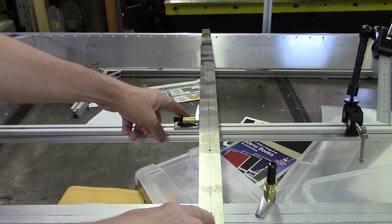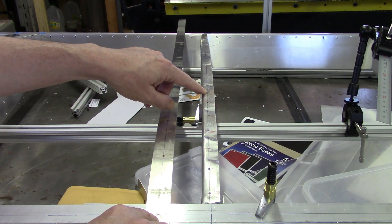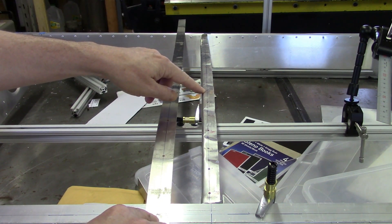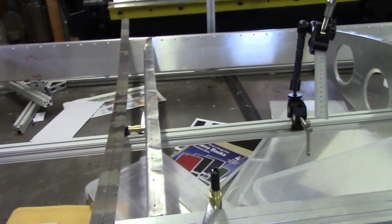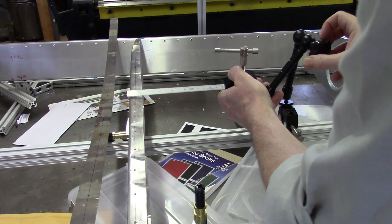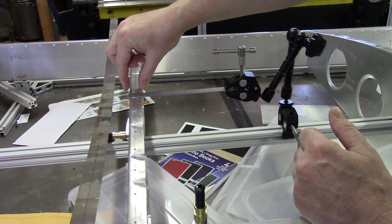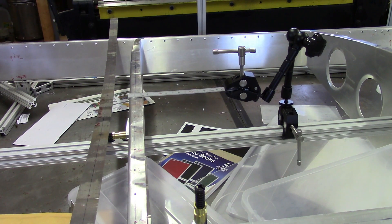This also allows me to do test fits with my wing skin — where I have my holes drilled, I can go in and see where the holes line up exactly, which allows me to more finely tune the positioning of the rib. Of course, one of the things I run into is, if you make your marks and then pull your wing skin, how do you know how much you need to move? The way I got around this is using an articulating arm clamp holding a ruler, and I can just line it up over the location I want to align, take note of where the center line is versus where the hole is, and adjust the position of the rib from side to side to get everything exactly where I want it.